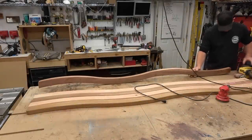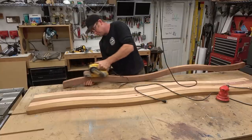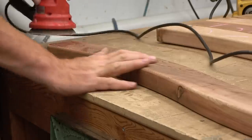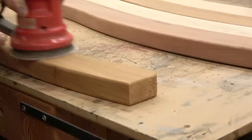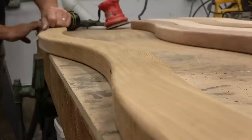Western Red Cedar is a fairly soft wood, and sometimes the bearings on the router bits will leave marks. So I'm coming back with a belt sander to clean that up, plus any milling marks the flush cut might have left. I only sanded the outside edges of the two outer planks on the bench. Those are the only edges that will be visible once the bench is put together. I also sanded the tops and the corners with 150 grit sandpaper.